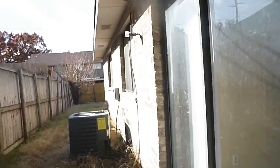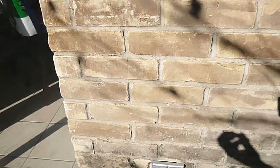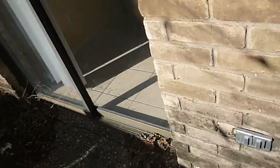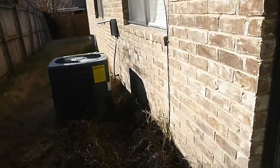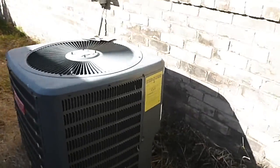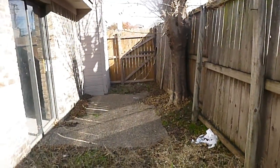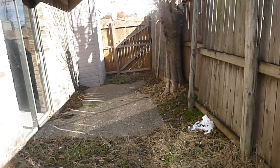An in-use cover is not present here, and there's no GFCI. The reason I'm not calling out that these condensing units do not have service outlets is because there's always a service outlet by the back door where the dining room is — or in the converted dining rooms in structure one. There's a receptacle outlet a technician could reasonably use to get electricity to work on this system. That's it for the backyard, structure two, unit three.